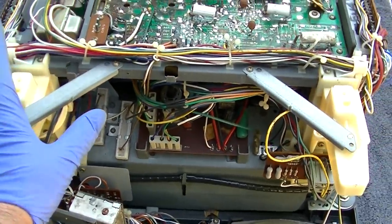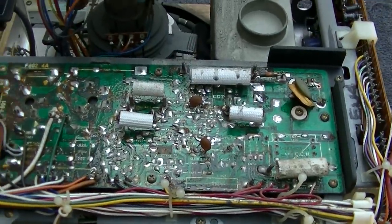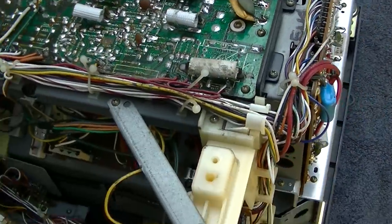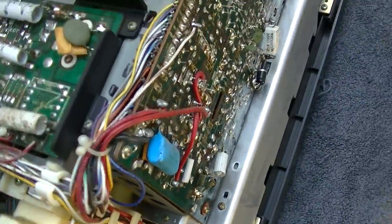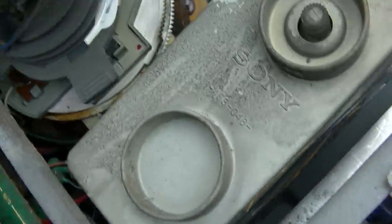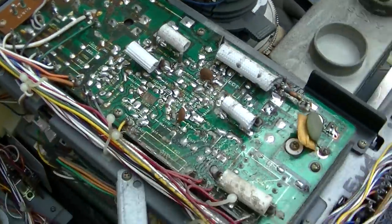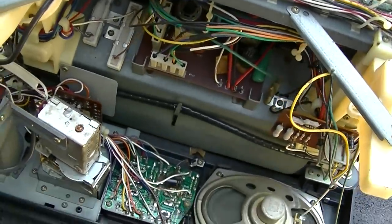Anyway, if you should be so lucky as to find one of these, do not just plug it in and turn the power on. Do not bring it up on a variac. Take it apart and inspect. Inspect. So where is the flyback or high voltage generating transformer?